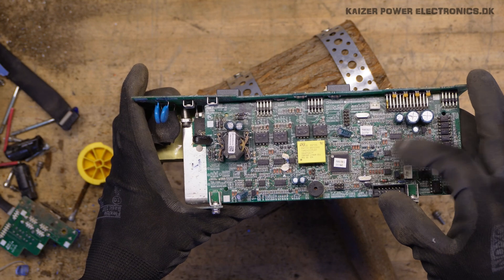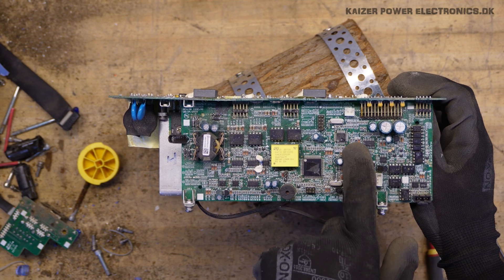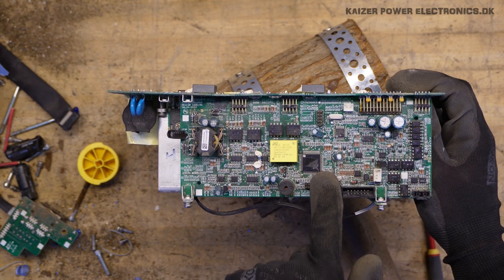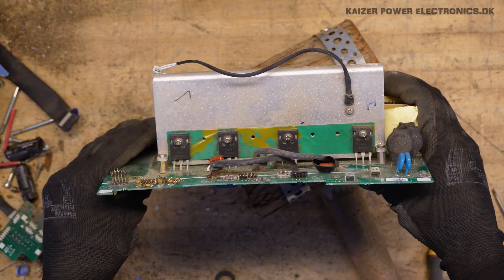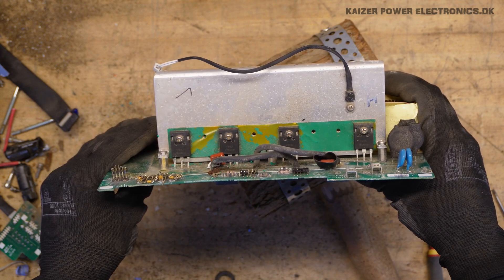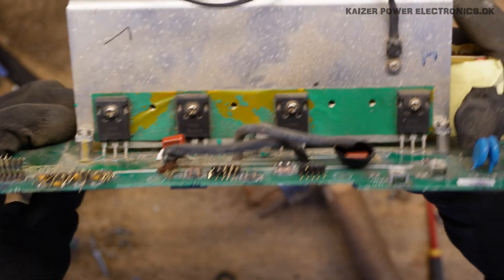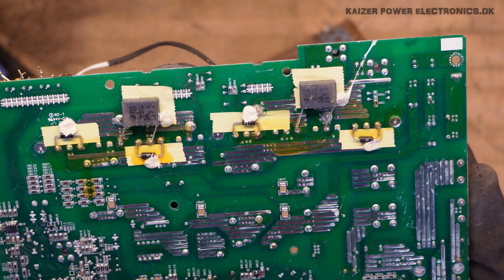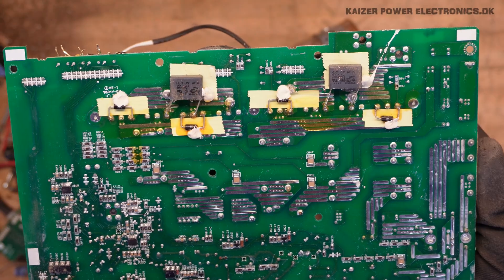There are 16 MHz and 4 MHz crystals. It is really hard to tell the manufacturer or part number of these microcontrollers — over here it's ruined from conformal coating, but over here I can see it is a Freescale, some kind of M-series. At the output inverter part, we have the same switches seen earlier — Infineon 47N60, so 600V, 47A — with four of them sitting here. But the back side is really interesting: somebody had noise issues and had to add capacitors and diodes to mitigate switching transients, with caps and tape and glue and everything.